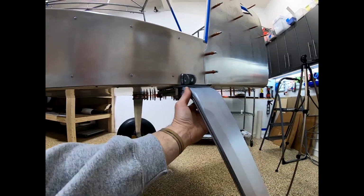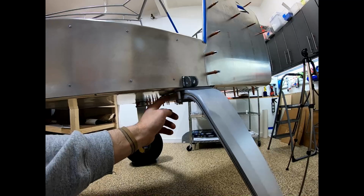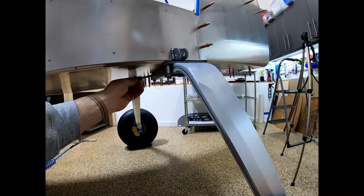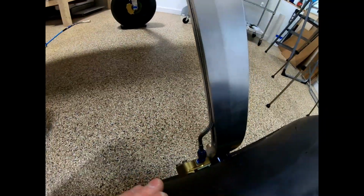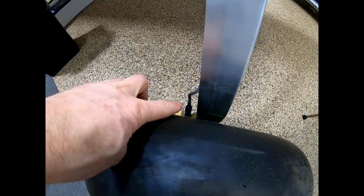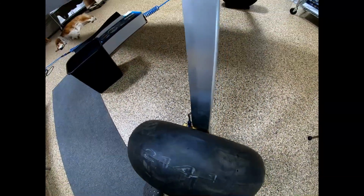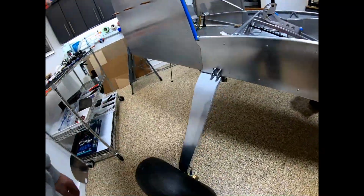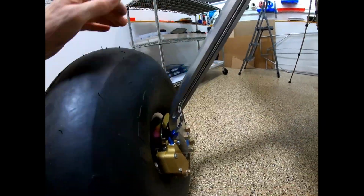You had to, you know, kind of tap it in with some wood around the bend here, but took the landing gear bolt out, ran it on the inside there. I'm gonna kind of see where I think this hole will end up best. I left a little bit. I basically made the 45 so it aims up parallel with this, and then put a little bit of slack down there. Torqued this guy to 120 inch-pounds with a little crowfoot thing, and did the same thing on this side. So that was really nice.